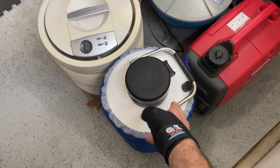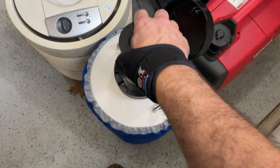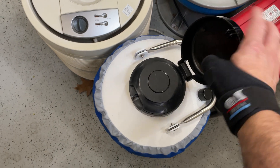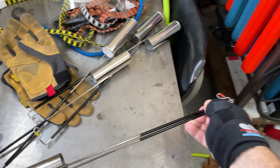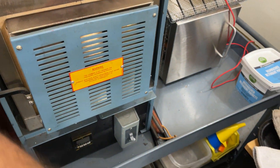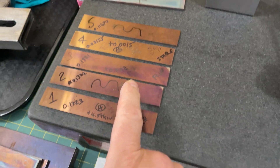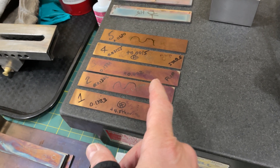Greetings, fellow artisans. You may recall when we last met our heroes that we had completed the liquid nitrogen cryo treatments of our parts. We took them out using our sample cups and successfully brought them over to the oven, where we performed a tempering operation to 425 degrees, which is 25 degrees lower than the original temper.